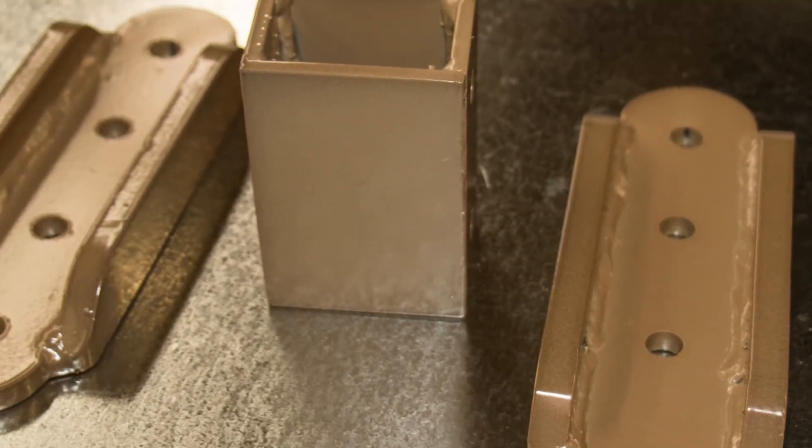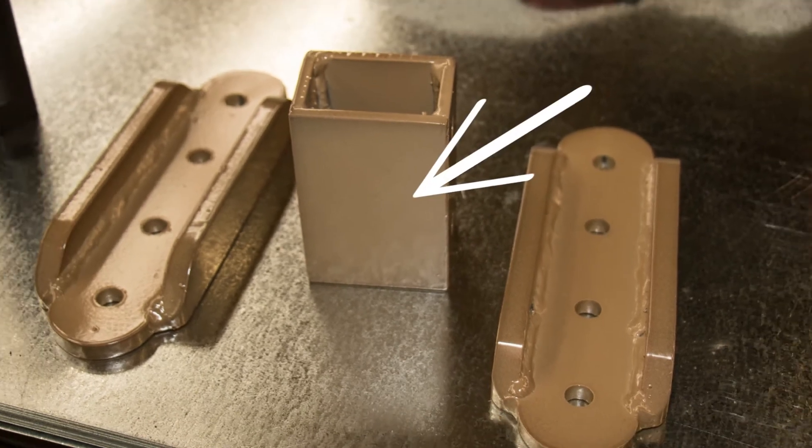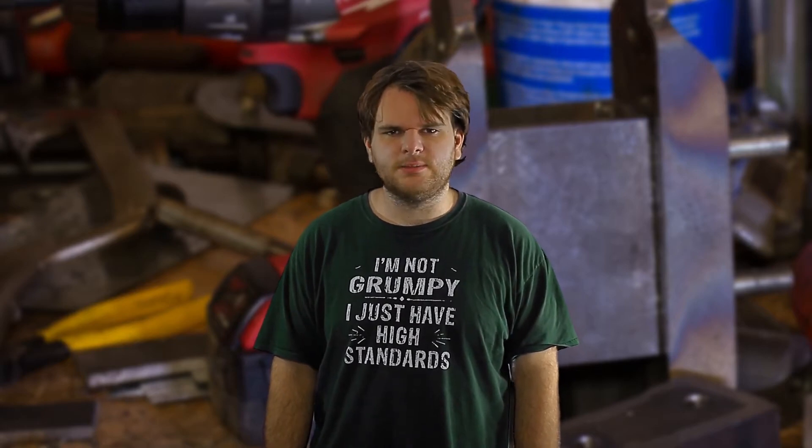You may notice a third part in this pic — that thing is a spacer. This is recommended on shackle lifts. The longer the shackle, the more torque that is applied to it. The spacer helps keep the shackles from over-deflecting, keeping the suspension stiff.